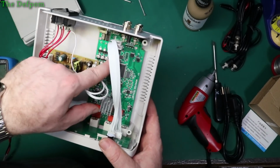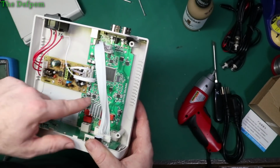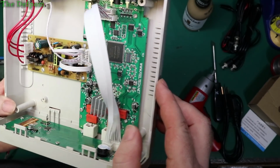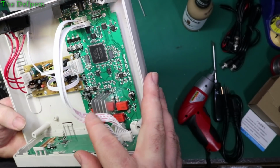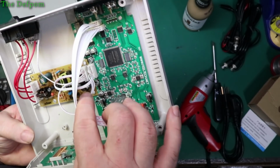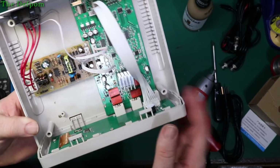So these light voltage regulators in the back here, I guess. Reference crystal. Some trimmers here for various adjustments. Can't see them being marked for anything in particular, just adjustment markings. It's an Altera FPGA, Cyclone 4. So, some relays on there for each output.